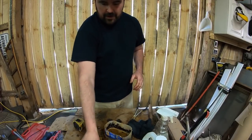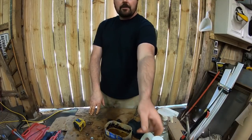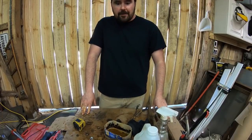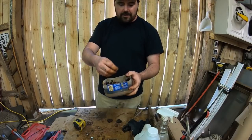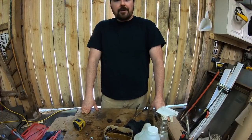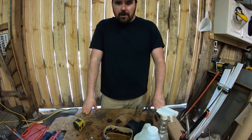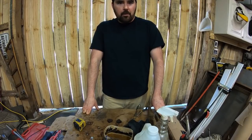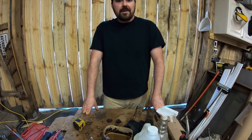That's just about it. I just want to show you guys it's definitely nicer having a bolt that looks like this instead of like this. White vinegar is my go-to setup — it's cheap, certainly cheaper than commercial rust remover products, and it's not harmful. You can put your hands in it; worst case it smells like vinegar and it's certainly not going to harm your skin. If you guys have any go-to concoctions you use to remove rust, I'd love to hear about it — put it down below in the comments. Hope things are well, hope you don't break off any more bolts and nuts, and take care!